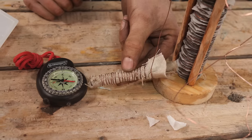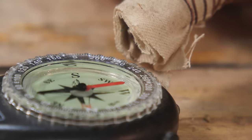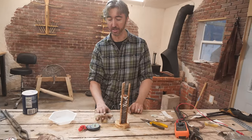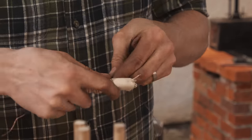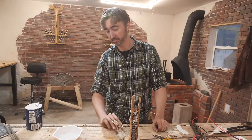It's enough to prove the concept. We are getting decent voltage — that's like a 9-volt battery right there — but we're operating in the order of milliamps. Improving the battery and not using bare wire would be nice, because the more tightly wrapped the coil is, the more power we're going to get out of the magnet. Many more turns of wire would definitely help, but it works.